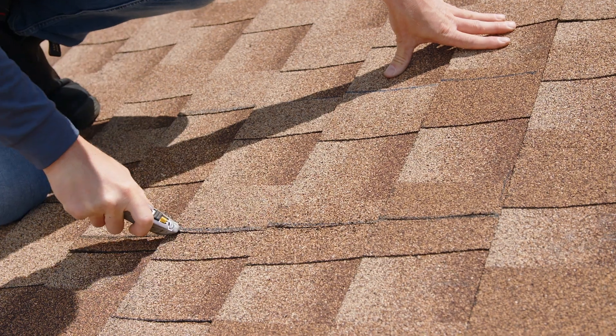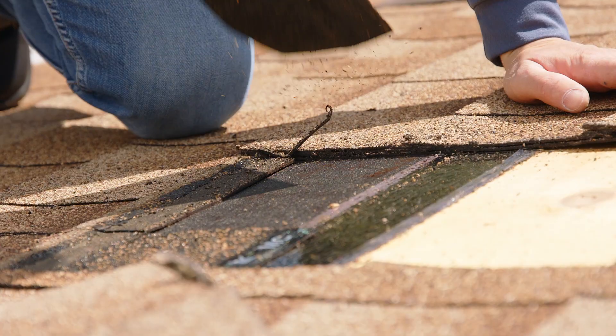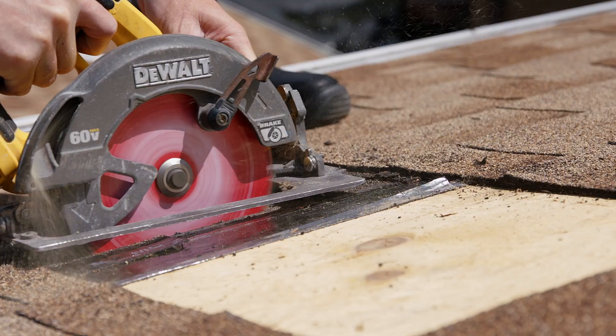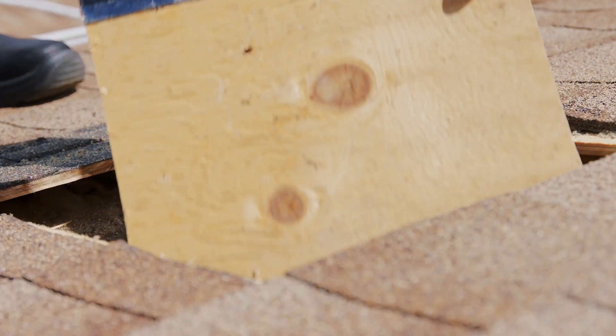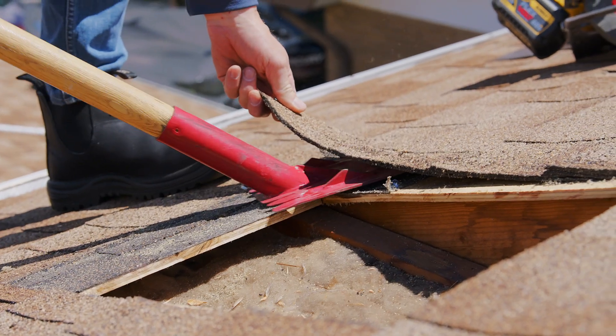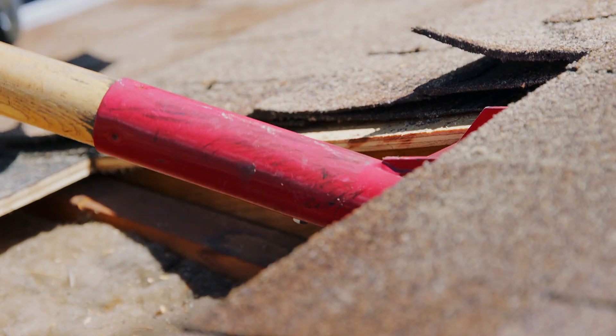Using a sharp knife or a roofer's knife, follow the line that you've traced and cut the shingles out. With the nails removed and the plywood exposed, you can now cut the plywood using your saw. With your plywood cut out and removed, pop the nails around the hole to ensure that the vent can slide up under the shingles smoothly.